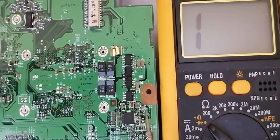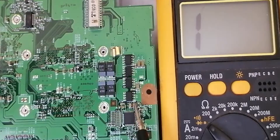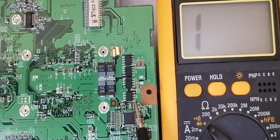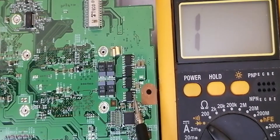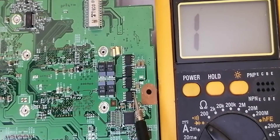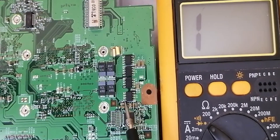If you focus here, for example for this first MOSFET, we have a white mark here — this is pin number 1. Pin number 2, pin number 3. So these 3 pins are source. The 4th pin is gate, and the other 4 pins are drain.